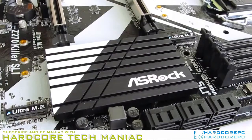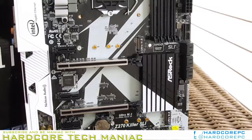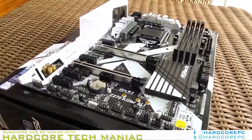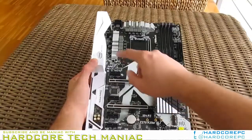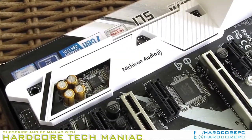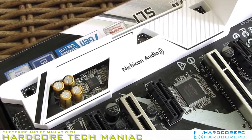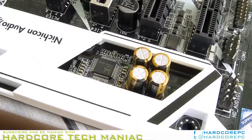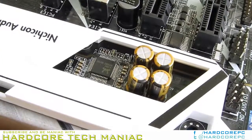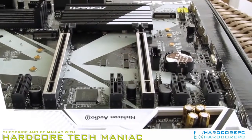The lack of any 4-lane bottom slot and the paucity of third-party controllers means there aren't many configuration limits resulting from resource sharing. Both M.2 slots share SATA resources with a SATA port, but installing a PCIe-based M.2 card eliminates that issue. ASRock reduces the number of fan headers to 4, and only one of these can be switched between PWM and voltage-based speed control. That one header is upgraded to 1.5A capacity, compared to the 1.0A max output of the other 3.